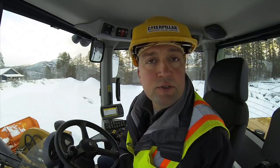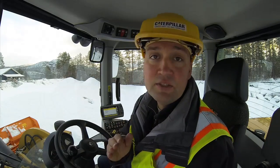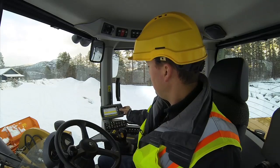As you can see, with high-stat mode we get excellent control in precision pick-and-place type environments. Now that we've been introduced to the new operator modes in the K-Series Small Wheel Loaders, let's put them to work. Here in application, I'm in a snow-filled parking lot where ice mode is the correct setting to help me do my job. Into our secondary display, we can navigate down to ice mode and we're ready to go to work.